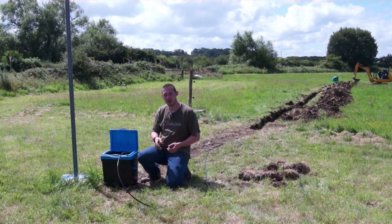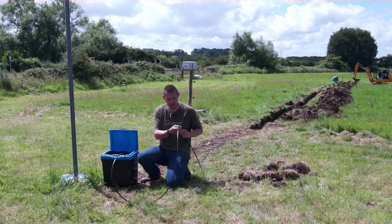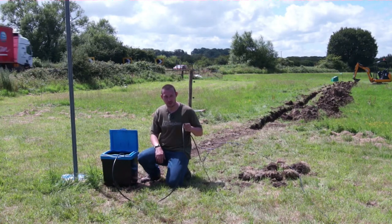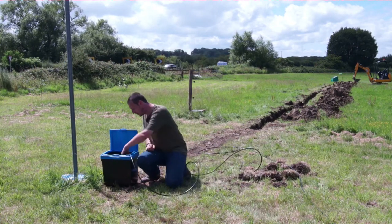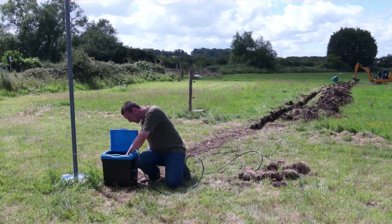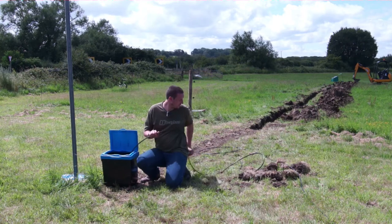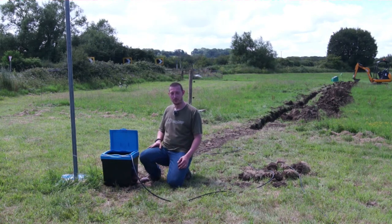What I've done now is pulled the string tight, taking all the slack out, and I've measured out the length of my feeder cable to the ditch in the ground to make sure it wasn't too long or too short. So I've actually measured the feeder cable this time. I've taped it onto the end of my bit of string and I'm going to poke it down inside the pipe which comes up inside this box. In theory, when I go and pull on the string at the other end, it should pull my feeder cable through.